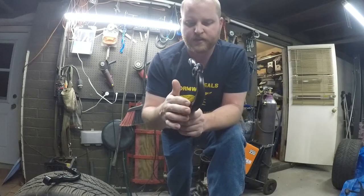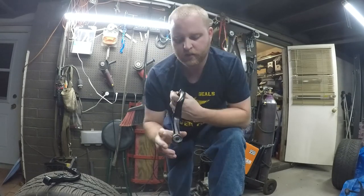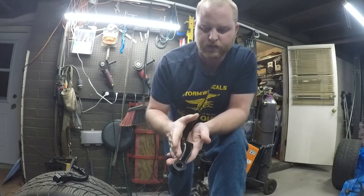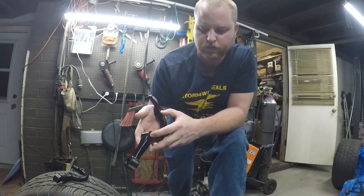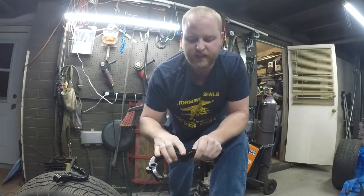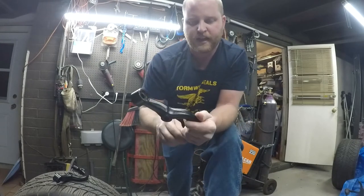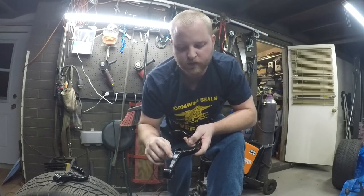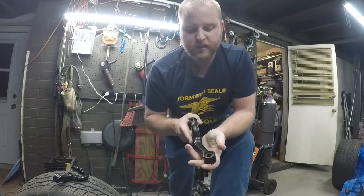So this side is in line. There is a groove here that goes around a casting, a part of the casting on the spindle. Here's my solution. For these bosses on both sides where it's machined - this is a forged steel and these are machined flat - the bosses are drilled for the bolts to go through and bolt onto the spindle. What I came up with is actually kind of self-aligning because this is designed to sit flush. I'm going to mark equally from both holes, make a cut across here, then bevel it. I'll take this front bolt hole, put it on that side, vice versa.